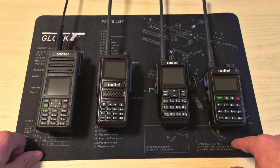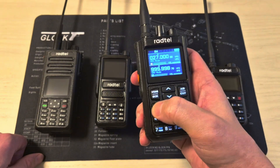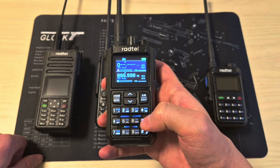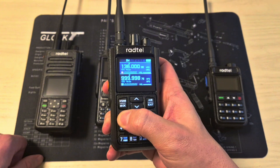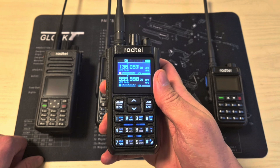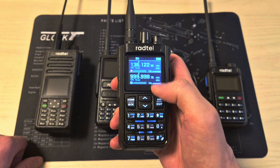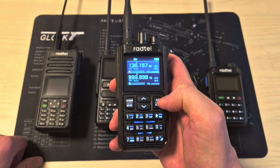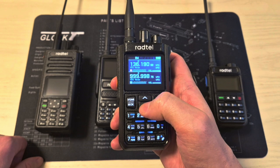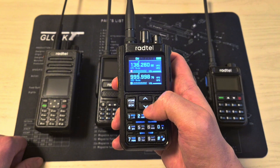If you think you can just buy a radio, leave it in the box, and use it in an emergency by using a random channel or by scanning, you're going to have a bad time. For example, you can start scanning — especially if you don't know the frequency allocation table and you start from 136 MHz. Let's say someone is transmitting at 136.1. You start the scan and they keep talking, then stop. The radio just passed over 136.1 and you'll never know someone was talking there. That is why you need to program these frequencies in advance — this way you can scan the channels or go to a specific channel and ask for help or listen for information.